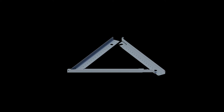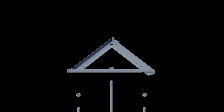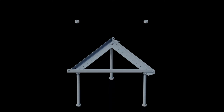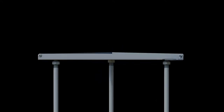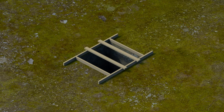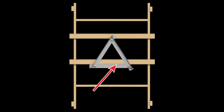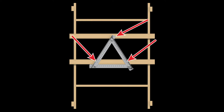The template consists of three pieces. Assemble the template by securing the pieces together with a 1/4-20 template screw at each corner. Thread a nut onto each UT base anchor bolt and slide each bolt through the template. Thread a second nut onto each anchor bolt just enough to cover the end of the threads. Tighten the lower nut to secure the template against the upper nut on each anchor bolt. Rest the two 43-inch long 2x4s across the concrete form, then set the template on the 2x4s so one 2x4 lines up with the inside edge of one template piece and the other is under the tip at the opposite side. Secure the template to the 2x4s.